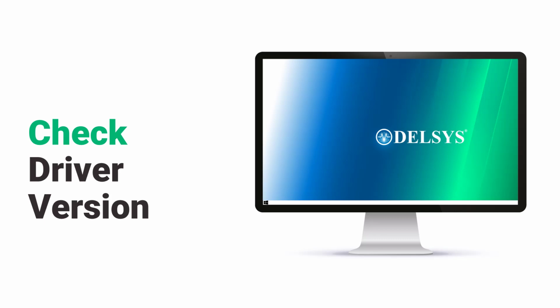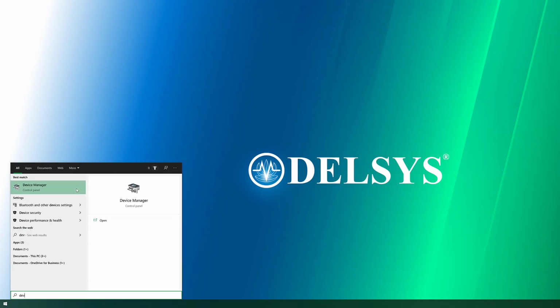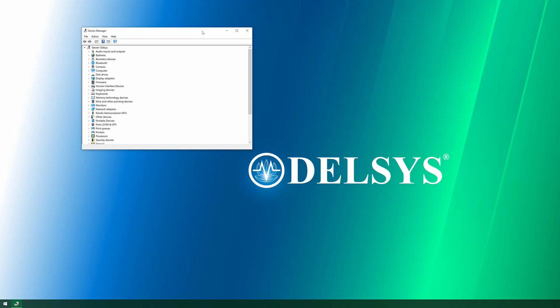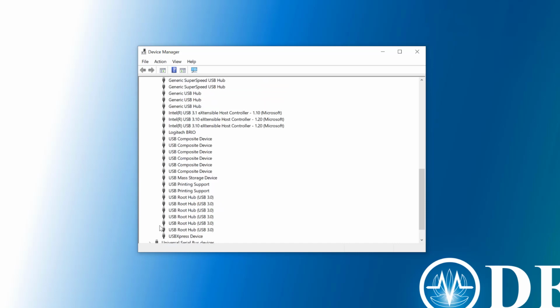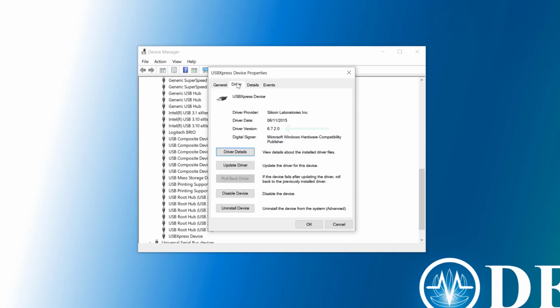To check the version of the USB driver that you have installed, connect your Trigno base station to the computer. Open Device Manager from your Windows settings menu. Navigate to and expand Universal Serial Bus Controllers. If you have your Trigno base station connected, you will see the device named USB Express device. Open the device properties and select the Driver tab. Here, you'll see the driver version that is installed.